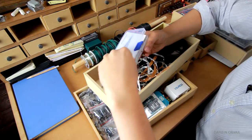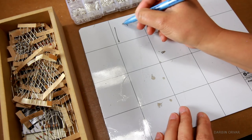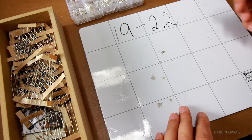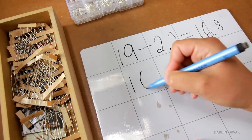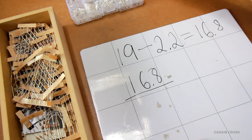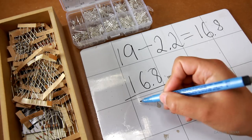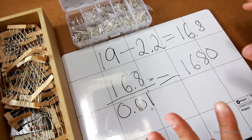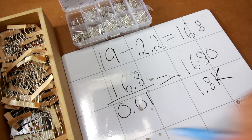I also have these single LEDs that come in different colors when you power them up. A frequently asked question I get is: how do I calculate which resistor I need for my project? So let's do a quick example. Say we have 19 volts coming in and we want to power one of these lights, which uses about 2.2 volts — you can often read this on the package. We find the difference: 19 minus 2.2 equals 16.8 volts. Then we divide that by the current the LED draws — I measured about 10 milliamps on my variable power supply — so 16.8 divided by 0.01 equals 1,680 ohms. You don't have to be exact, so I'd look for a resistor around 1.8K. That's how you calculate which resistor you need.